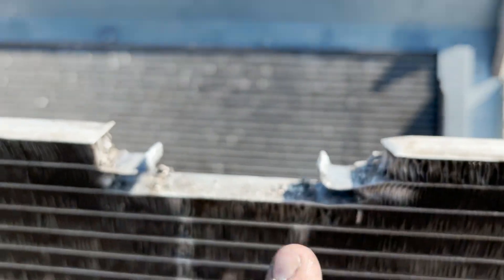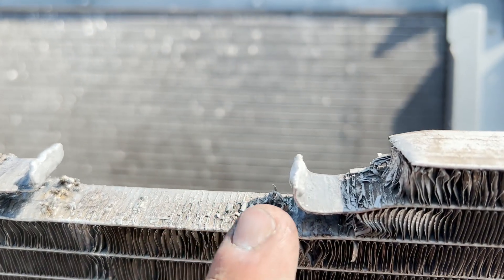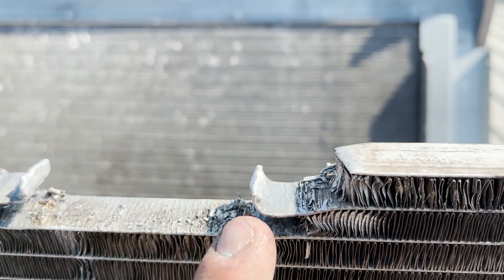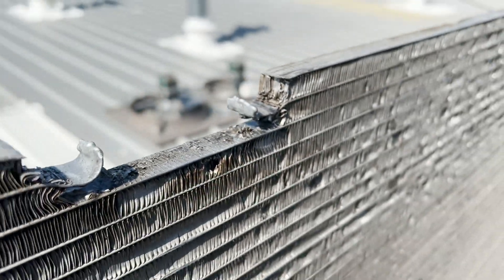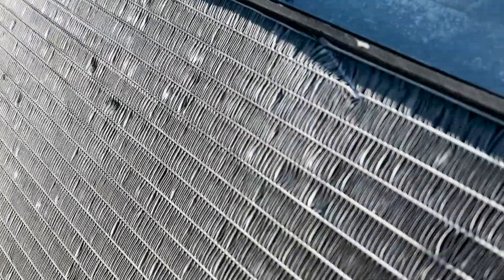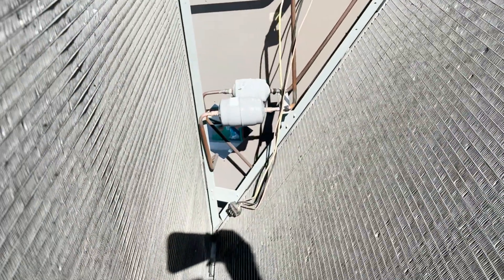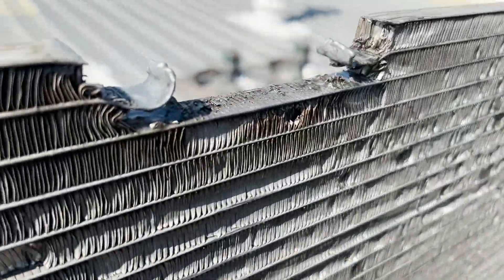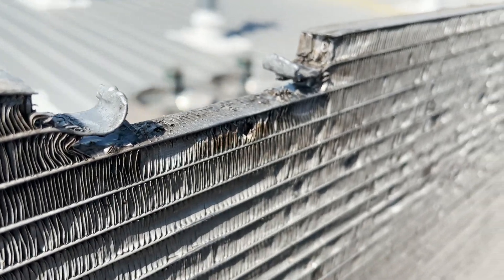I think I'm going to build a little deal for this. As soon as that melts, get that flame off of there — this is not a braze rod, you can't feather it. There's our repair. We're going to build a little doghouse for it. You can see this coil is pretty beat up all over the place, but we're on a standing pressure test right now and we're looking pretty good. Plus we've got a fresh filter dryer in there because we opened the system up. The section that was affected is removed.